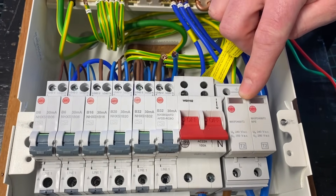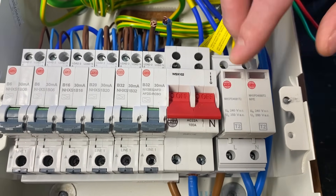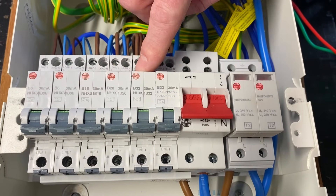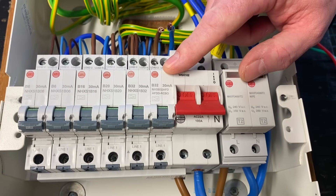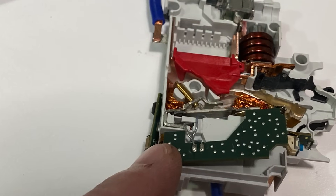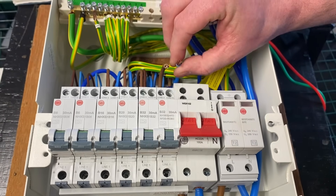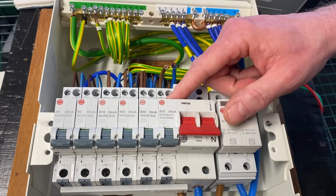The on-site guide says to make sure your SPDs are disconnected when carrying out your insulation resistance test, as well as RCDs, because they contain electronic components. We've got a row of RCBOs which will obviously have electronic components, and this is an AFDD — effectively it's got a mini computer inside it — so the last thing I'd want to do is pass 500 volts through it and potentially damage it. So I'm thinking I'll just leave it disconnected, carry out my insulation resistance test, and then reconnect it and torque up the settings accordingly.